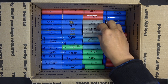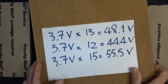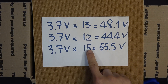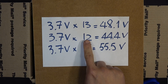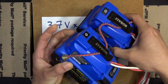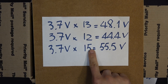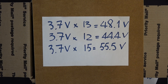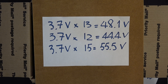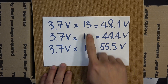The motor is rated at 48 volts so I need to build my battery pack at least 48 volts. These 18650 cells are rated at 3.7 volt nominal, so 13 cells in series will produce about 48 volts. Usually a 48 volt battery pack can be between 12S and 15S. A 12S pack is a bit under voltage but would still work. A 15S pack will give more torque and speed but risks damaging the controller due to over voltage. So I'm going to stay safe and build this pack the same way as the original: 13S7P.